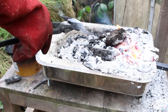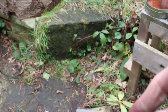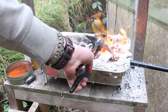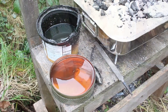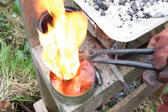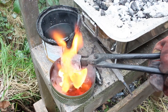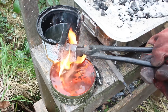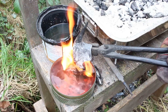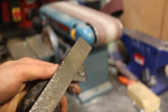It would probably have been a good idea to not use a plastic container for the quench oil. After heat treatment, a file skates completely over the entire spine of the tomahawk, meaning it's fully hardened. If a file doesn't skate over it you need to re-harden it. I then heated up the blade of the tomahawk using the same method and quenched it in motor oil, rapidly cooling it. I tried to keep the previously hardened spine as cool as possible, but inevitably it got a little warm and lost some hardness. I didn't actually temper this tomahawk separately — after heat treating the blade it was still very hot, so I left it to cool naturally in air for the final couple of hundred degrees, and I think that tempered it fine.